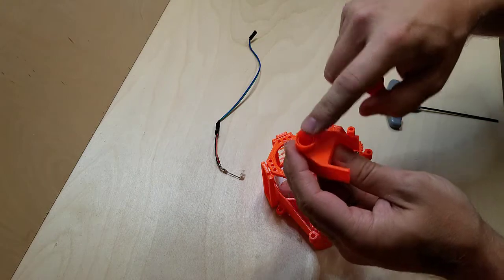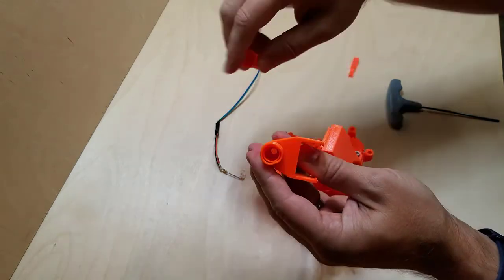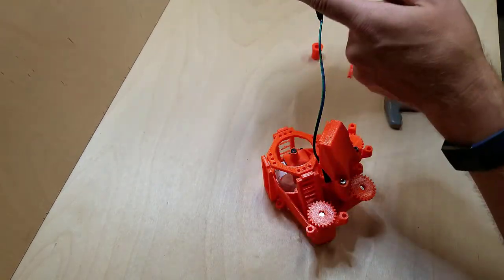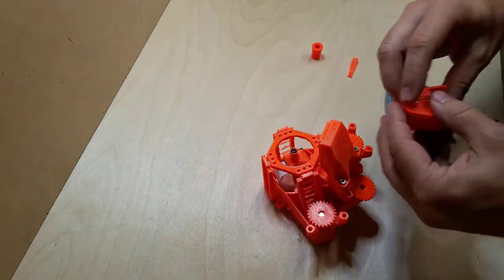So you would use this to help press the lens in here as tight as possible. And what that's doing is it's taking the light from up here that's shining down into the condenser lens, and it's going to spread it out to be even over the sample piece.